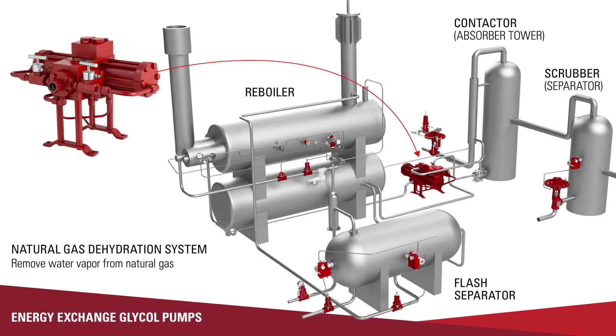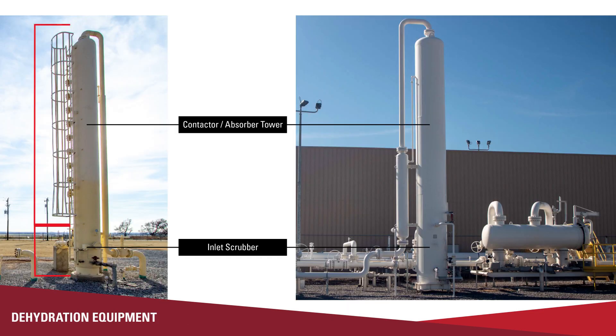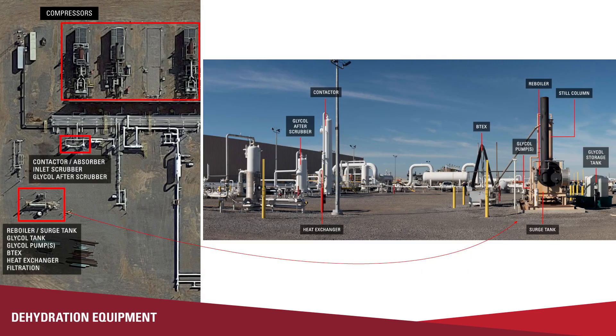You can see our glycol pump there in the middle. The two pieces of equipment on the right side are an inlet scrubber and then the contact tower, or some people call it an absorber, but those are the two pieces of equipment that the gas will go through. Normally this equipment is downstream of compressors, so after the gas is compressed it will go through this equipment. Sometimes this equipment can be directly on the well location with one dehydration system per well, but a lot of the times these are in gas gathering systems, so it's really big equipment. Gas is gathered over a certain area, comes into one common line, and goes into one dehydration system.